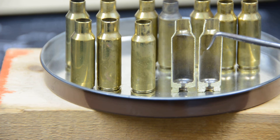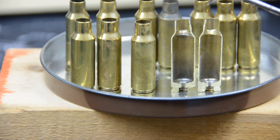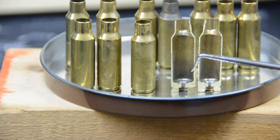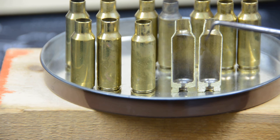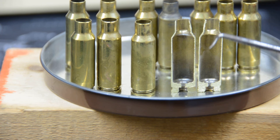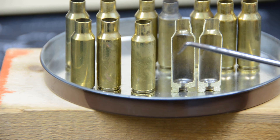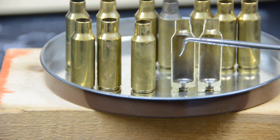The quality of this bulk brass is lower. I suspect there's a reason it's being shipped in bulk. Make that judgment for yourself. Another viewer of the channel and a fellow member of the Facebook group is seeing this exact same thing, so it's not just my brass. The case heads themselves were perfect — not damaged, not gouged by the extractor, no high-pressure damage — because I had not excessively loaded any of these. Stayed away from the maximums. The brass shows it: extraction is in very good shape. So be careful if you have this brass, keep your eye on it. Be safe in your shooting and always inspect your brass.